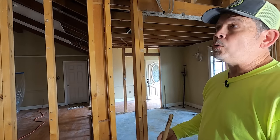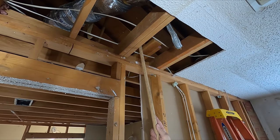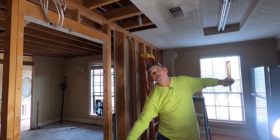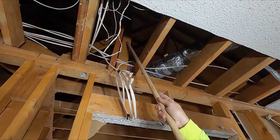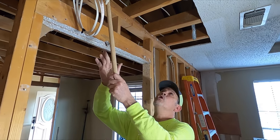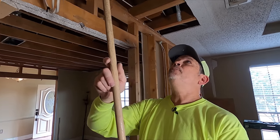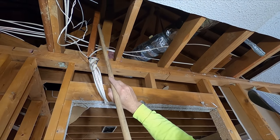So let's take a look at these walls and see what they're holding up. This wall is holding up the ceiling joists all the way down, so we know we're going to have to support these temporarily — otherwise if we pull this wall out, that whole ceiling comes down. We also have a brace going up to the roof, as well as another one at a bit of an angle. We're going to remove those two, but before we do, we'll replace them with a brace on top of our new wall. We're going to build a temporary wall right here to hold up the ceiling.